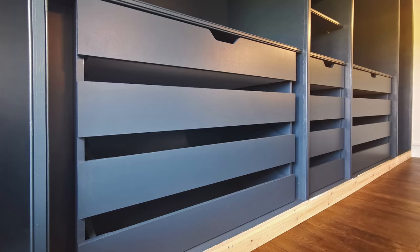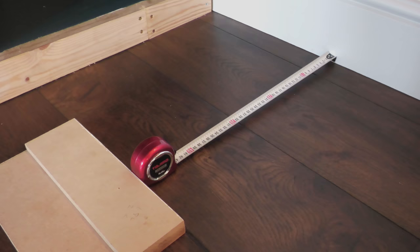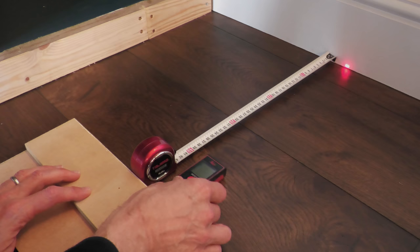Let's start with the drawer units. In my last video I got this first bank of drawers installed and then confessed that I made the remaining two - the remaining eight drawers - two millimeters too wide. There was a reason for this: I relied on my laser measure which over-calibrated the width by two millimeters, and I know this because I've since tested a set distance with both this laser measure and my standard tape measure.